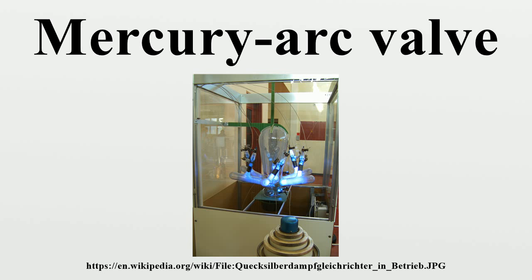The Inter-Island link was the last HVDC transmission scheme in operation using mercury arc valves. It was formally decommissioned on 1 August 2012. A similar mercury arc valve scheme, the HVDC Vancouver Island link between Vancouver Island and the Canadian mainland, had been previously removed from service. The mercury arc valve converter stations of the New Zealand scheme were replaced by new thyristor converter stations, and the Vancouver Island scheme was replaced by a three-phase AC link. Mercury arc valves remain in use in some South African mines, Kenya, and on the Manx Electric Railway on the Isle of Man.